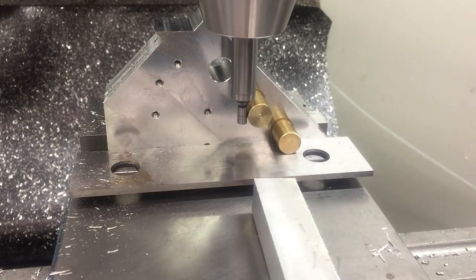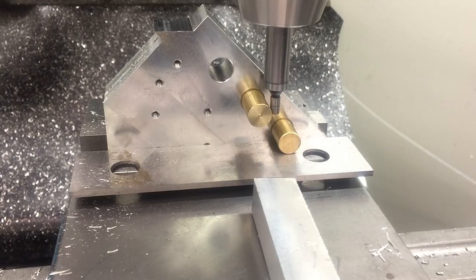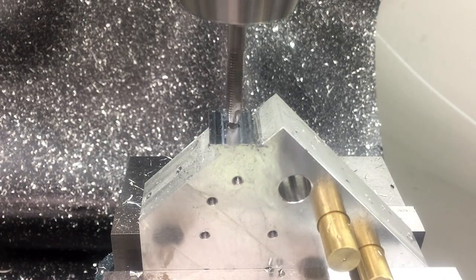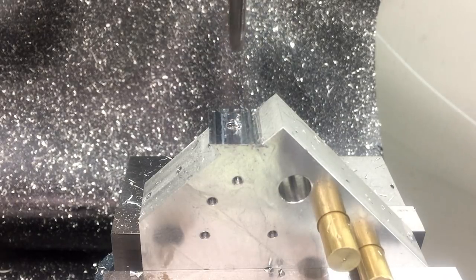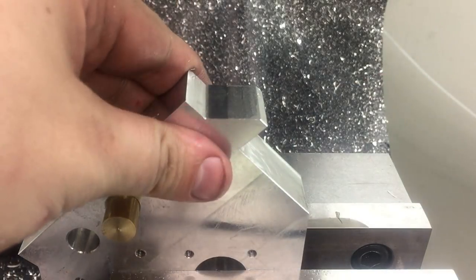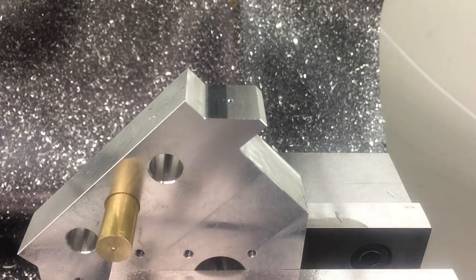This is the other application of these little holes — I can use them to edge find on the sides. So if I'm drilling a hole on an angled surface where I don't really have any great locating features, I can actually get a fairly precise position for it. Again here I located off that center dowel, so I can get a pretty precise position on this hole.